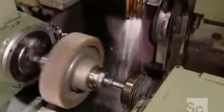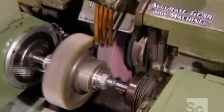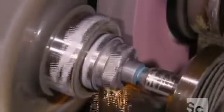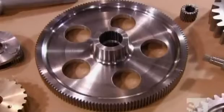When the furnace reaches a certain temperature, they inject carbon inside. The gears absorb it, and the steel strengthens even further. A soaking in oil afterward hardens the metal. Heat treatment, however, distorts steel somewhat, so each gear now goes to a computer-controlled grinder. It restores them to very precise specifications for bearings to fit properly.